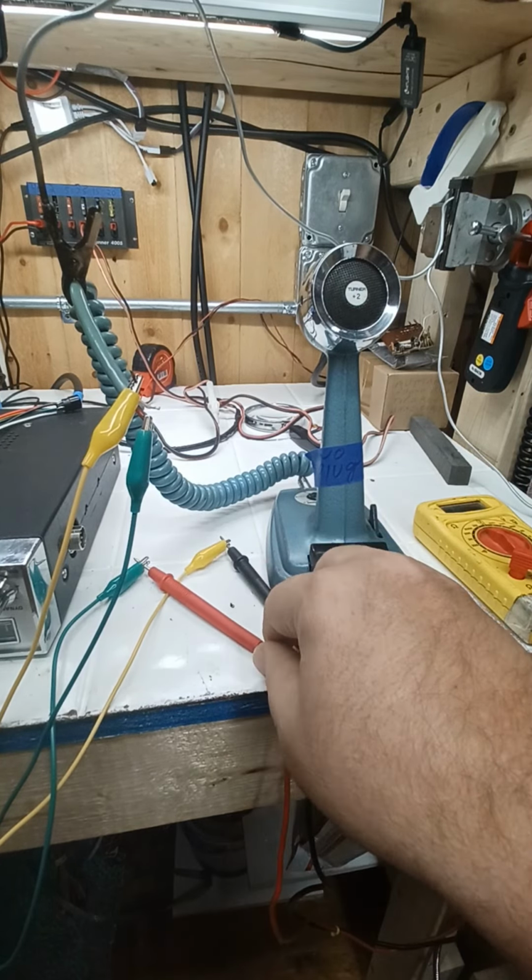So here's what we do. We get the test leads hooked up. We just pick 2 wires. And I'm using this just to hold it up to keep it in camera's view here. I always like to start with the shield, the ground wire, whatever, the bare one. And then I chose red, just because, right? Now we got to make sure none of these other ones are touching there. I see they're touching. We want accuracy here, right? Okay, so we got the ground and the red.